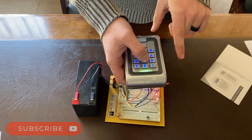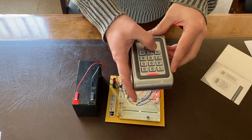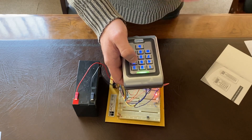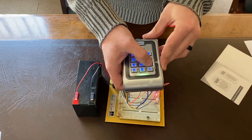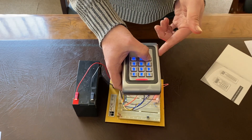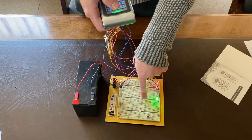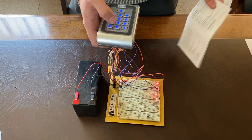After entering the user number, press hash and give it a PIN. If you have two doors, the PIN should also start with the relay number you're using. The session timed out, so going through again: option 11, user one-four-seven-eight, hash. Note down that user number because you can manually delete just that one user later. Give it a PIN — one-four-five-eight. That's accepted. You can continue adding users or exit by pressing star twice. Once exited, you can test your PIN — relay one, door one just opened. You can also set the timing of that relay on the same page — we'll cover that in the next video.